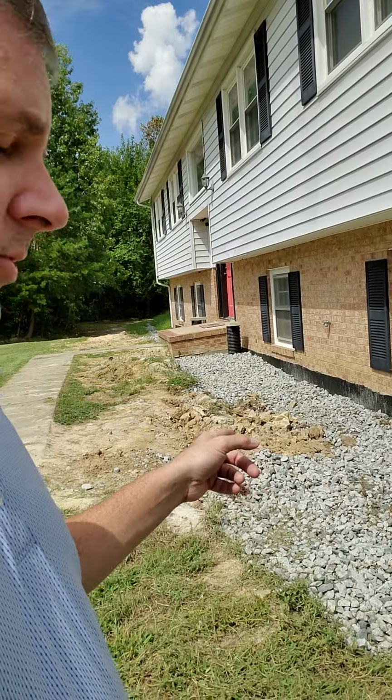So then I transitioned and took my time, walked down the pipe, and I would actually drill halfway around the pipe. And then just every couple inches, another hole, a series of holes. So we got all the pipe dug, drilled out, all the holes perforated. And they tell you, lay in, you want the holes facing down in your trench.